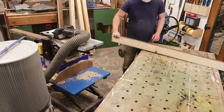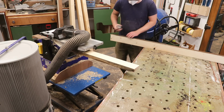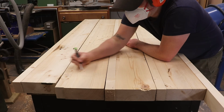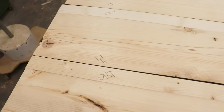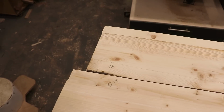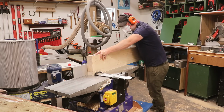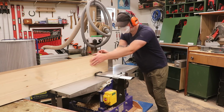I'm going to prep these leftover bits of 4x2 as well so that I can add just a little bit more width to the top. Neither of these bits are long enough though, so I'm going to need to splice them together. For the rest of the milling I'm going to use the in-out method, which is basically where you alternate which way you feed each edge through the planer to give complementary angles. So even if your fence is out of square slightly, they'll all still come together perfectly. So for example, for this edge it says in, so I need to flip this and face it inwards towards the fence, and then the next one will be out from the fence, and so on. Not sure I explained that very well, so I'll leave a link to another video for more detail in the description box.